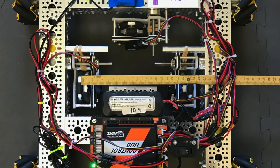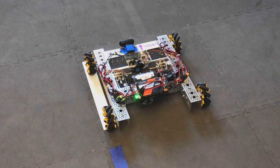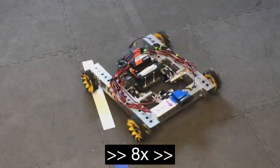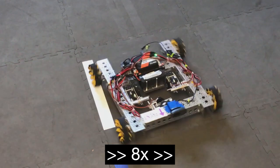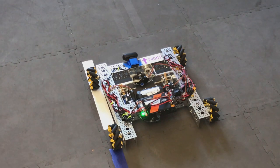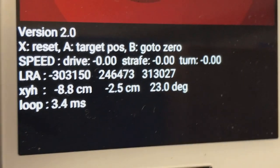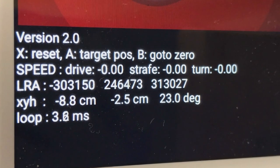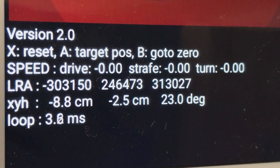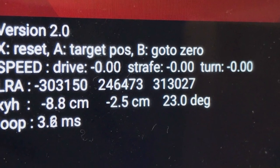First, we will look into calibrating the constant L. Got an initial value of exactly 20 centimeters when measuring the distance between the left and right encoder wheels by hand. Then, we had the robot spin around its axis 10 times. The final measurement angle was off by 23 degrees, or 2.3 degrees per rotation. The value of L had to be nudged up to 20.12 centimeters for an optimal calibration. Similar adjustments can be made for the other parameters.